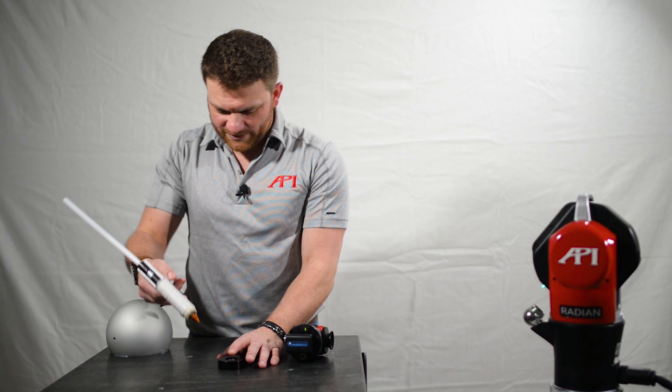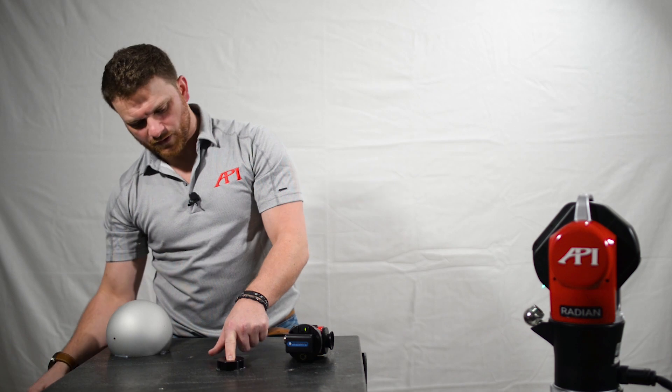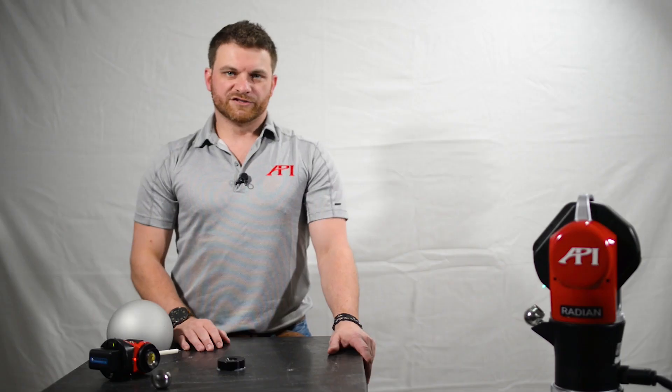The first time you use a new probe tip, you're going to want to validate that probe tip to make sure that everything is meeting our spec. To do that, you're going to take a measurement with the probe that will coincide with an SMR measurement and compare the two together to get the deviation. The easiest way is to take a standard puck and glue it to a surface and allow the glue to set so the puck won't move when you take the SMR in and out. This reset sphere has the same centering as your standard SMR, so we will do a direct comparison between the v-probe measurement and the tracker measurement with the SMR.